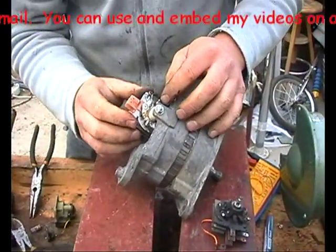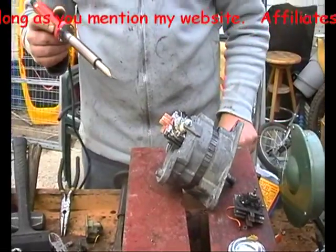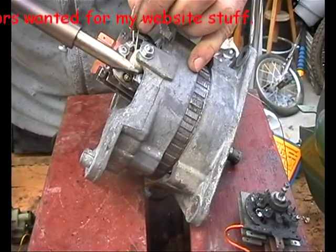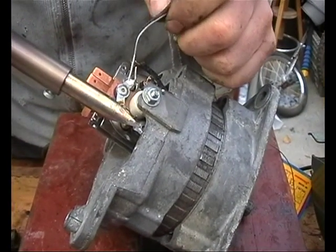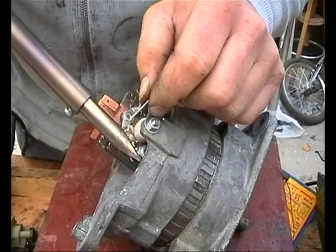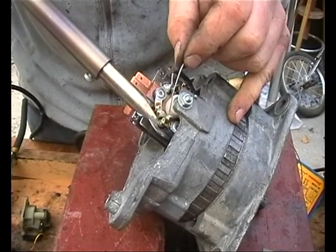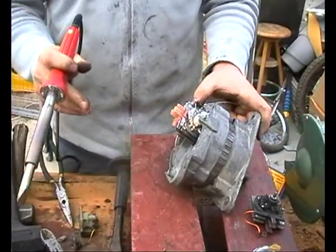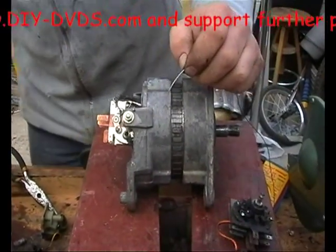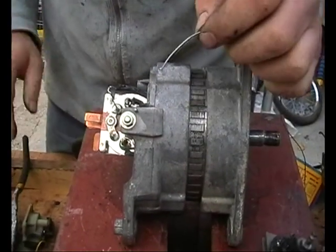So, cheap — nip it up with the pliers. Right, okay, so let's see if we can get them stuck. Always have plenty of solder reeled out. Beautiful, that's getting cool. Make sure you don't drop any solder down into your windings, so probably a better idea to have the alternator at least level so any blobs that fall off you can pick off. Let's just position that a bit better — pinch it back up, get that one soldered on.